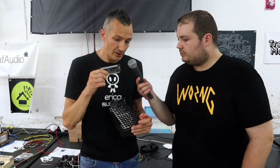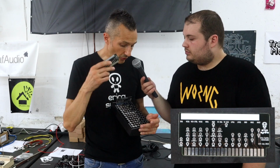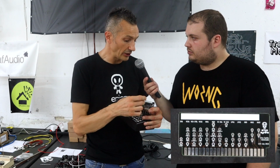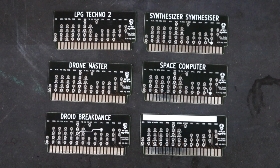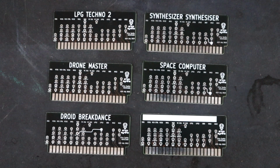We also have a DIY voice card, an empty one. So you can use small wire jumpers, solder them in to repeat the patch on the modular synthesizer. And you can even use resistors here to attenuate signals. So basically you can turn all controls, like, most clockwise and make attenuation on the voice card, so it will automatically adapt to the potentiometer settings here as well.